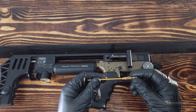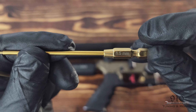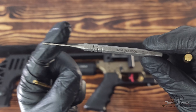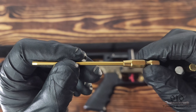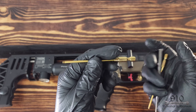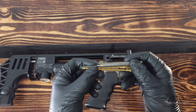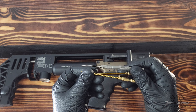There will be three tools that you need. The first is a 1.5mm Allen. The next will be a 5/64 inch pin punch or smaller. And then the last will be a 2.5mm Allen. These don't have to be speed drives or quick connect drives like this — they can be standard hex keys as long as they're the right size. And it can be smaller than 5/64, that's just what I'm using today.